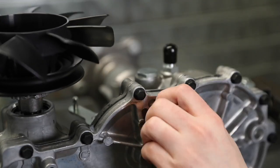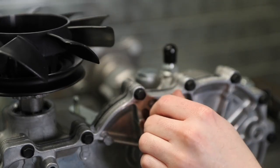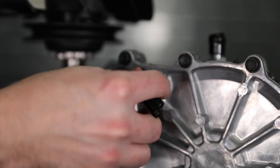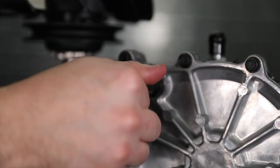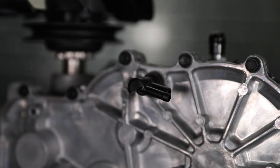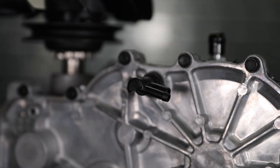On units with an internal expansion tank, your fill port will be the hex head plug located at the top of the drive next to the breather fitting. Unless replacing, do not remove the breather fitting. On these internal tank units, the oil fill level will be to the bottom of the hex head side port.